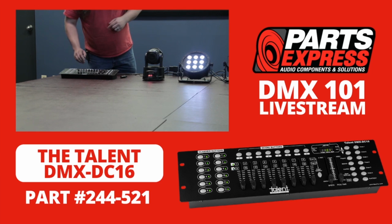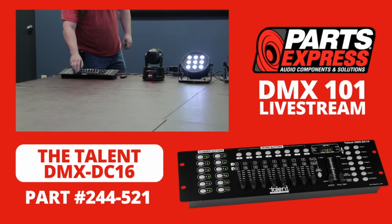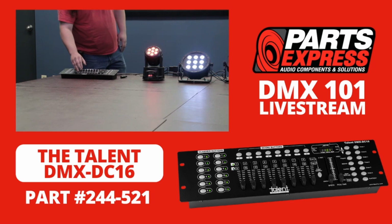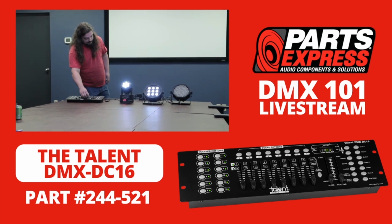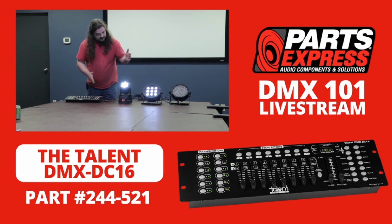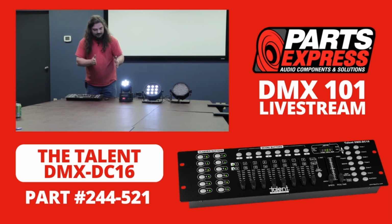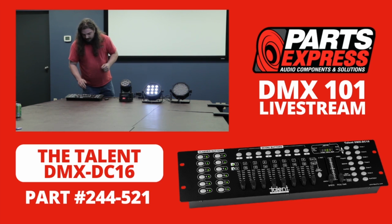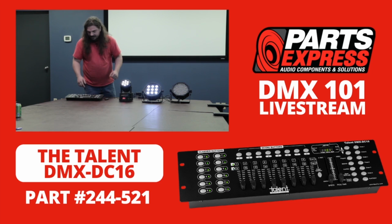So if I go to 2, I believe I've got this one set to 2. Now I can see if I play around with the first one, it spins. Second one will make it tilt. The third one will act like a dimmer, so nothing's happening right now. But if I bring up the fourth one, I'll start getting red and green and blue and white. So same sort of thing, but again, as you can tell, it has different channels. The channels are arranged differently from light to light. So it's really a good idea to always keep your manual available when you're programming. Once you've got it programmed, it's set, and you can just basically mash buttons.